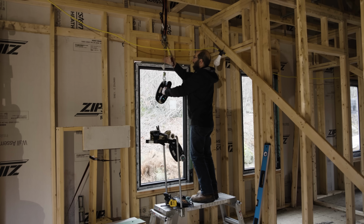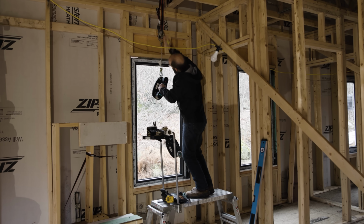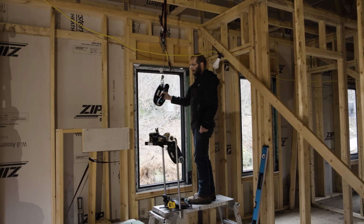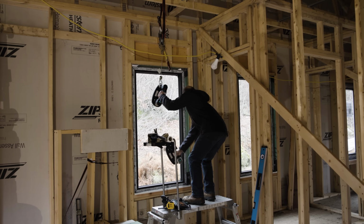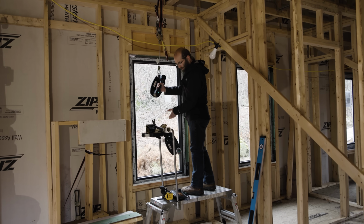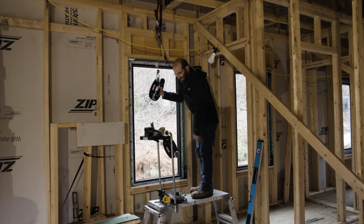Okay, now the come along has some slack in it. At this point, the window's pretty much stationary, but it's still not totally secure. Yep. So I'm on those shims. I'm not dragging the window on the stretch tape, so I'm not damaging that. I can move it around. And that's a plastic shim too, right? That is a plastic shim, yep.